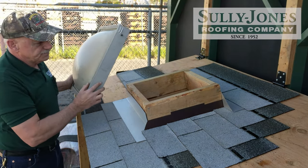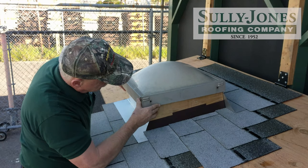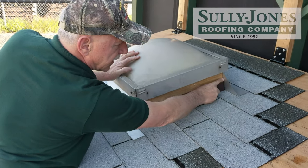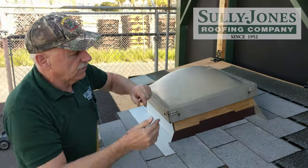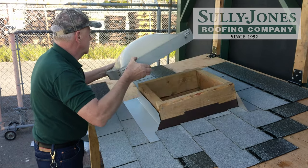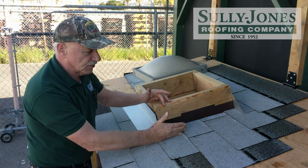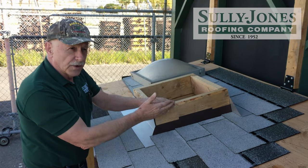If there's a skylight going on it and the skylight happens to hit right here, this saddle can be cut down and then angled out. You'll still have your angle out because you want to carry your water around, but whatever you're putting over the top will slip over. If it's a really high curb, you'll either have to use special tin shingles that are exceptionally wide — because you'd still want to come out at least three inches under the shingle — but it has to come up to the top of the curb or at least far enough under whatever is flashing it.